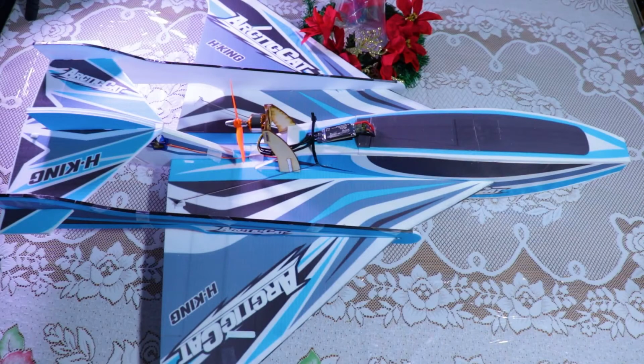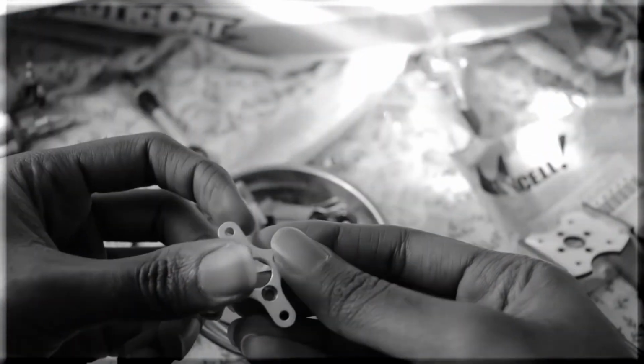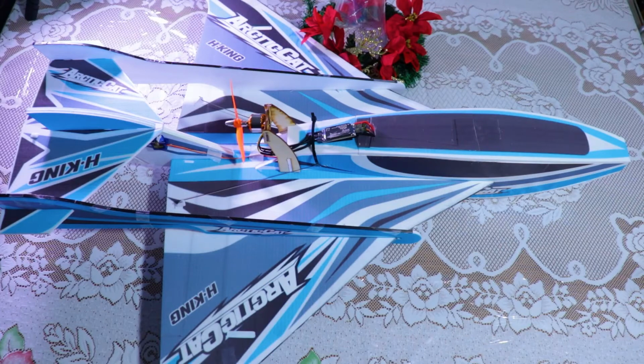While assembling this build, I learned something very important. Ensure that your electronics are compatible with each other. So this Aerostar reversing ESC has a standard 3.5mm bullet connection. My gem fan motor has a 2mm connection, I believe, and that wasn't fitting with my ESC. Also, the gem fan motor did not come with a metal X cross thing, motor mount adapter thing. Not sure what it's called, but the gem fan motor did not come with that.